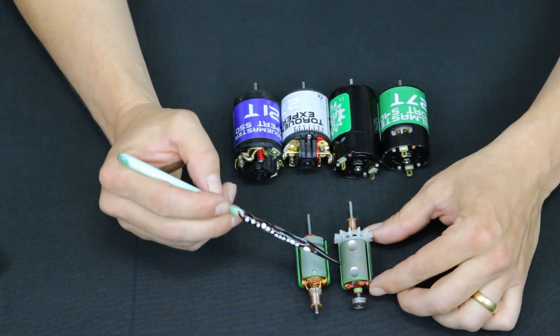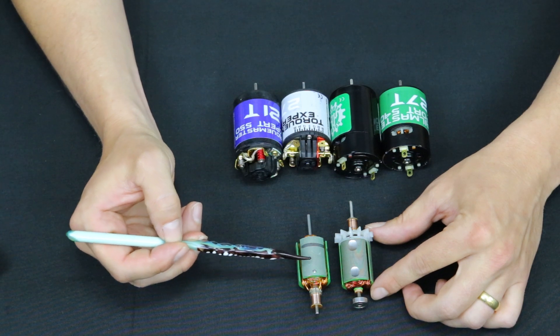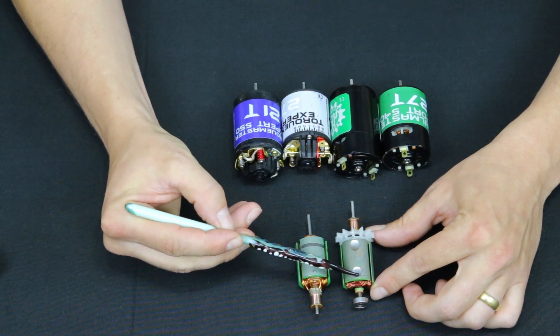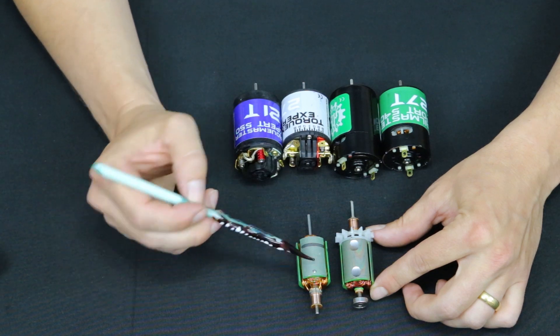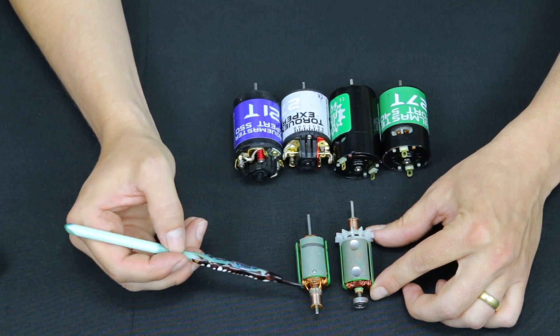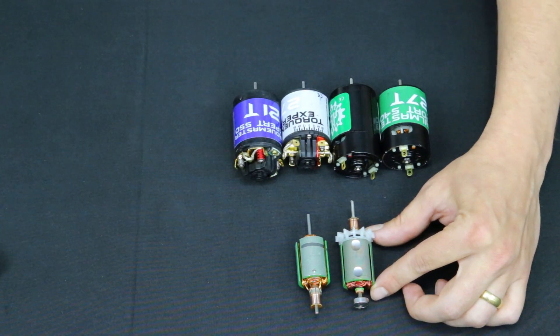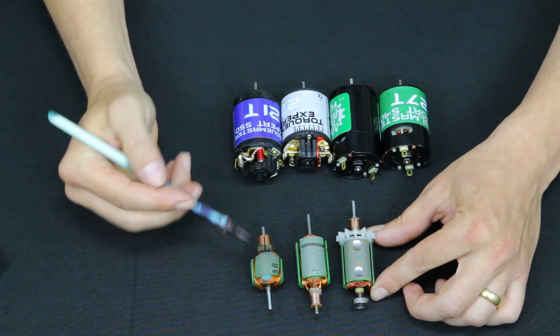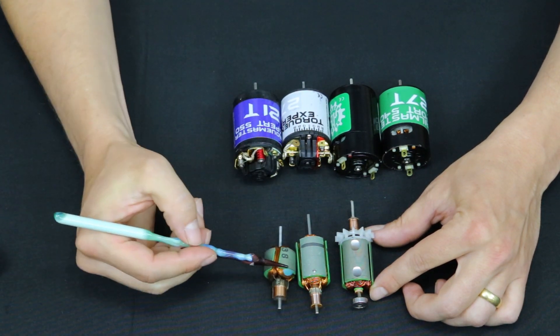And if you also look at the way that these are balanced, the more expensive TorqueMaster Expert has less no-load losses because of this right here as opposed to that. Now in our hand-wound motors, we don't even have any drill balancing — we just put some putty, some epoxy. We have one with epoxy balance. The epoxy balancing has even less no-load losses.